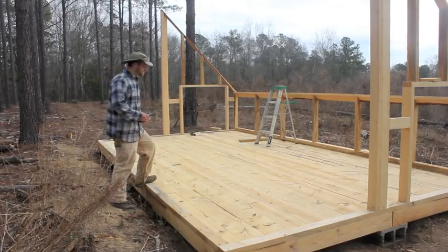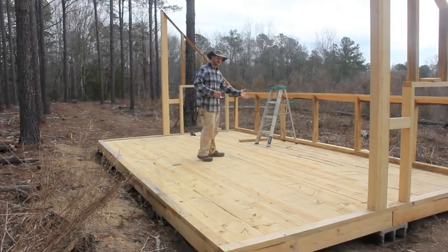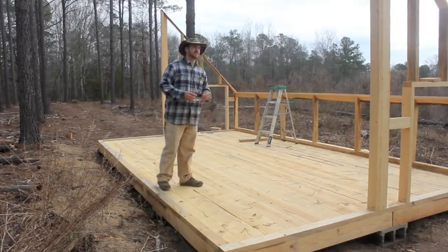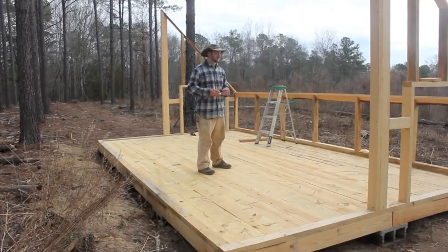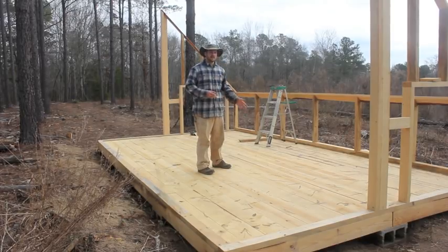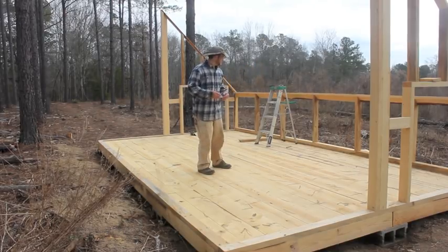I think what I'm going to do is, right in the very center of the kiln right here, there's going to be an additional wall, which will give me two chambers, and each of those chambers is going to have two fans from the back blowing the air down through the stack of wood, and that'll just give me some more versatility. That way I don't have to run the entire kiln if I only have a small amount of lumber. So I think that's what I'm probably going to do, and I'll have a personnel door in the back right here for quick entry, and we'll just go from there and see what happens.